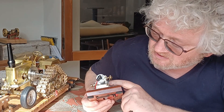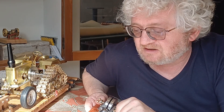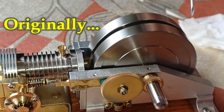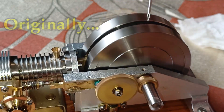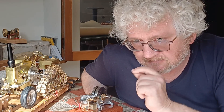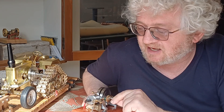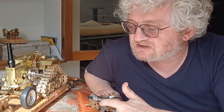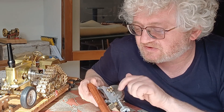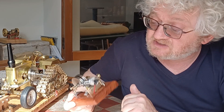Possibly the main thing for me was working on the latch - the hit-and-miss detent latch that goes across and holds the exhaust valve open so this can go through its miss cycle. We like it to miss, do a nice long miss and run as cool as possible. To start with I turned that latch around 45 degrees, and then yesterday I moved that very, very slightly and I think I've perfected where I want that latch to be - it's got hardly any lift. I haven't yet changed the exhaust spring which could be lighter; I don't think that's so important if you have the latch perfect. Yesterday I had a little bit of trouble with the spark sparking in the base rather than the engine - I may have to clean some grease off of that, it is still a bit greasy.